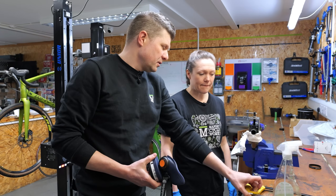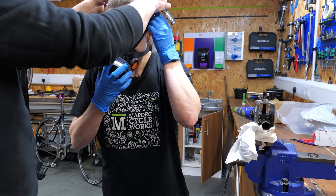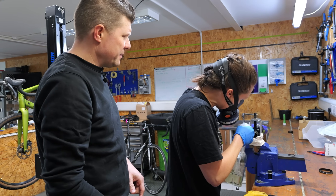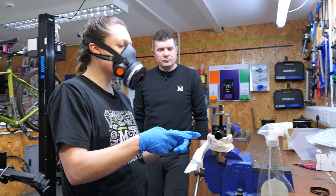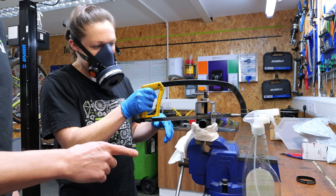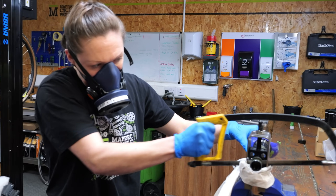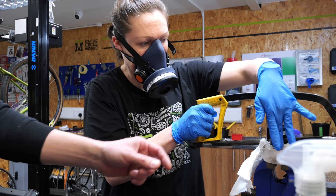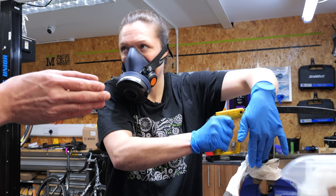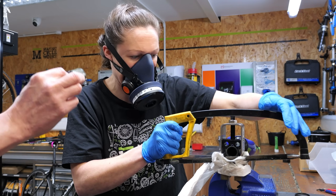We've set up an abrasive saw for cutting carbon. We're going to keep it really wet - everyone needs to put a mask on. Keep giving it a really good spray as you go - this is the cutting engine. We'll use this as the saw guide so your saw goes in here. Go slowly, keep an eye on it. As you get close to the end, try and hold on to the other side to stop it splintering at the last minute. Keep going, let the saw do the work - nice and steady, nice and easy. Perfect.